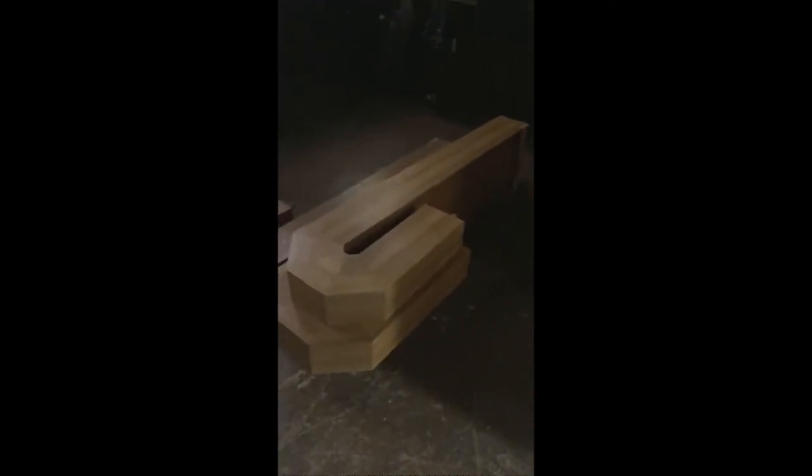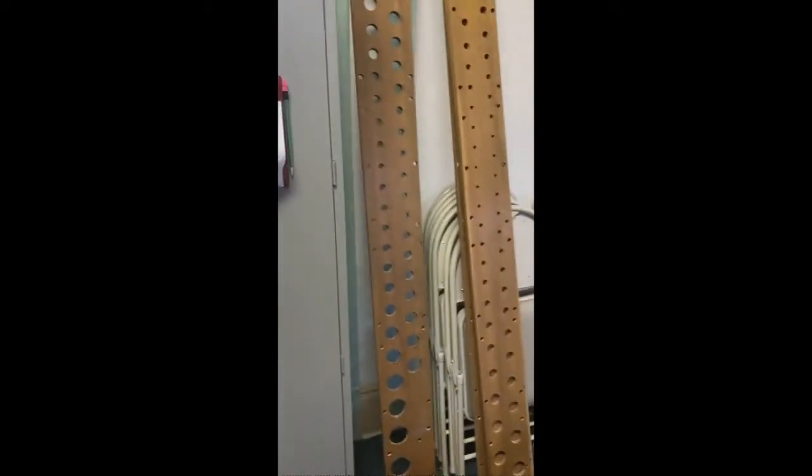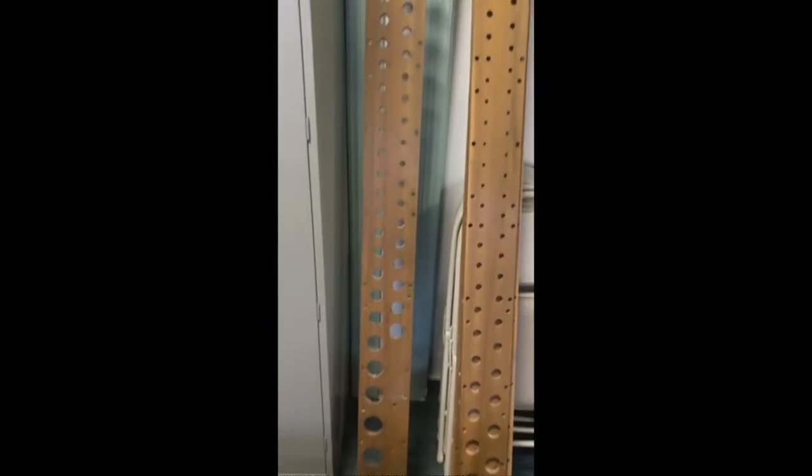Here we have crates of pipes. You can see some new tubes that will go in — these replace the old tubes and operate the wind chests. We can see some of the Bourdon pipes; some of the longer pipes are mitered over so they will fit into the swell box. Walking into the choir room, we can see some of the pipework and rack boards. These boards fit over the wind chests and support the pipes as they stand straight up.